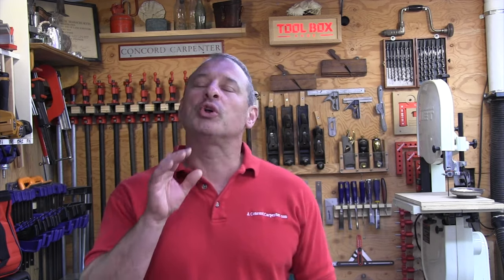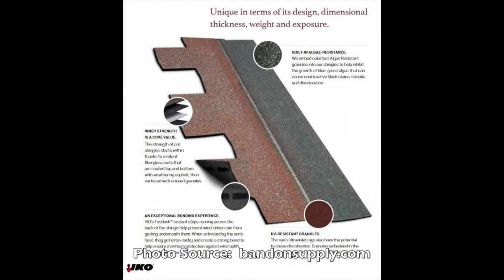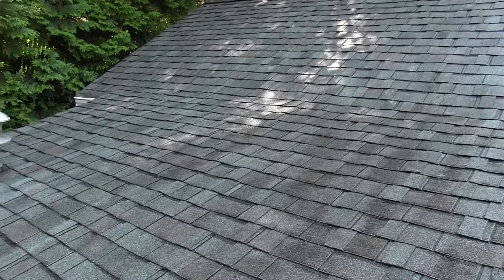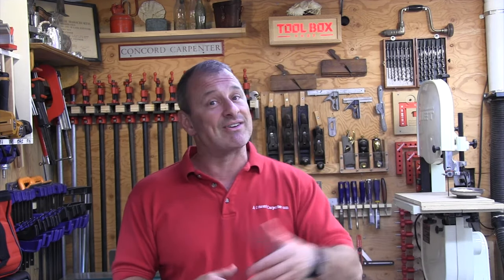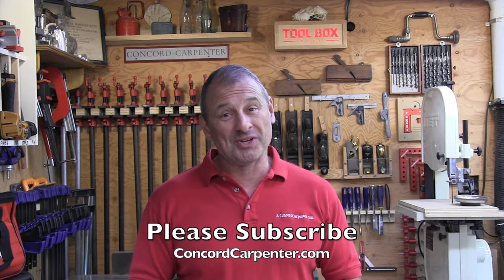Additionally, when you re-roof, you can purchase algae-resistant shingles. These look like normal shingles but have copper granules embedded in the asphalt along with the normal granules. The copper granules are embedded throughout the entire shingle, so when you do the whole roof you get a uniform cleaning and a uniform color and look over time. The active ingredient in a lot of these algae-resistant shingles is titanium dioxide, which keeps the algae down. It's a great idea and it doesn't really increase the price much. I'm Rob Robillard, and we'll see you next time at Concord Carpenter.